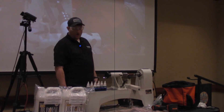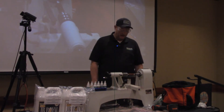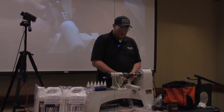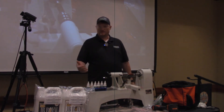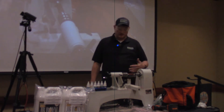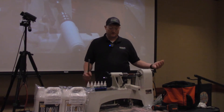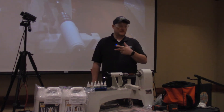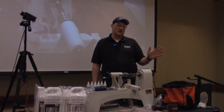My personal lathe at home is a Harvey T40 — I call that the Bugatti of lathes. I love that thing, it's my favorite lathe I've ever used. The T40 runs at 3000 RPM and you can't tell it's on — there's no whine to it. It's a servo motor versus this brushless motor, so they're different. Three thousand RPM is about where I stay for turning, sanding, and polishing — all at the same speed. I don't slow down for any of it.